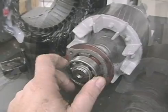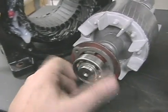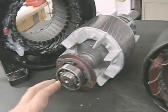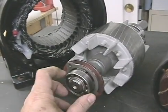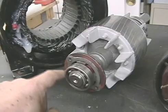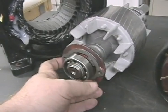Just a little tip: remove all that grease so there's not a speck of that viscous heavy grease — what some people call 90 weight — it's gear grease. These big motors didn't care if it adds a little drag since it's a 440-volt, three-horsepower motor. But in this application, if you clean it out well and seal it up with a silicone sealant, then fill it with machine oil, that works great.